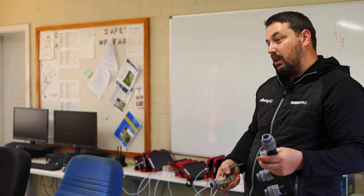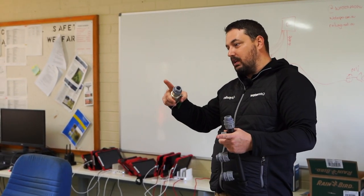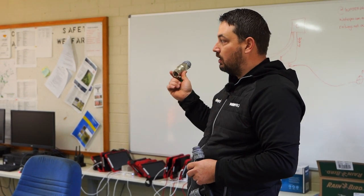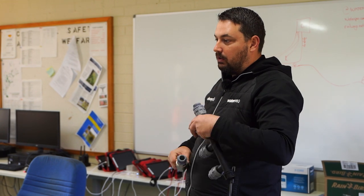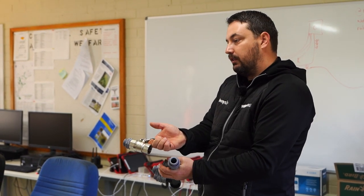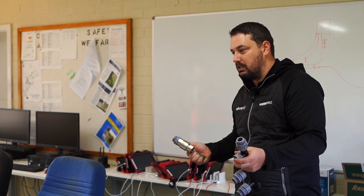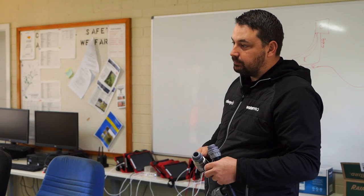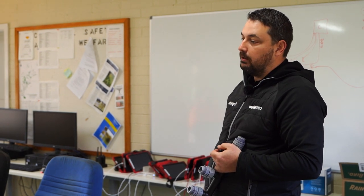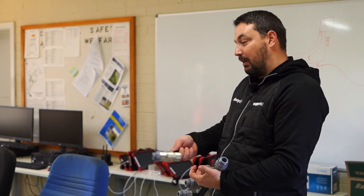Even with the 40mm stuff, the same principle applies. Coming up in 40mm is sufficient most of the time because you're not going to have a lot of pressure loss, and then we can go back up to bigger valves if we had to. The 40mm stuff is really handy - we've done it with horse arenas because they get a lot of foot traffic and movement, so pipes tend to crack or get shifted and snap. With the barrel union collar they can just dig around, move it back, tighten it back up again, and that might only happen once every two years rather than digging it all out.